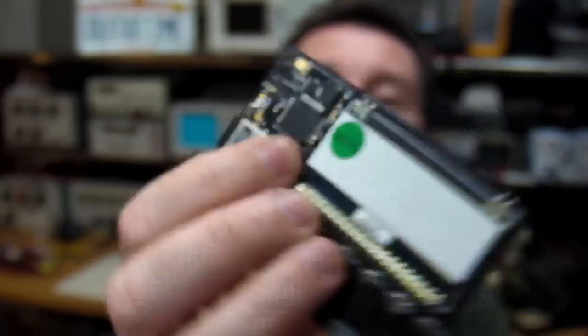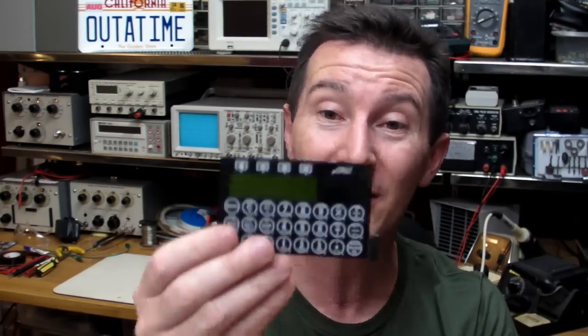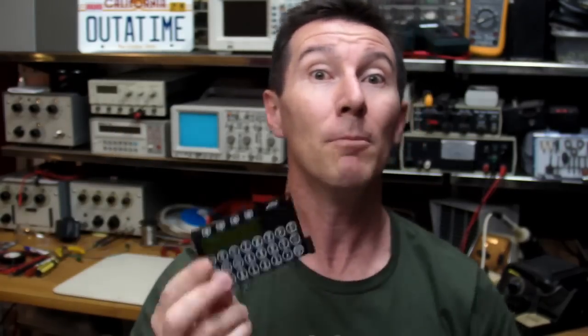Spec-wise, it's based on a Microchip PIC24F series 16-bit microcontroller. It's got 256K of flash, 16K of SRAM — quite a powerful little 16-bit micro. It's the same one used in my MicroWatch project, but with increased SRAM and flash memory. A lot of thought went into what microcontroller to use. Should I use Atmel, Microchip, or something else — a TI-MSP — because it's got to be low power. But these Microchip Nanowatt XLP micros are pretty darn low power. I also considered the Microchip 32-bit series and ARM, but lots of reasoning went back into choosing the Microchip 16-bit part.